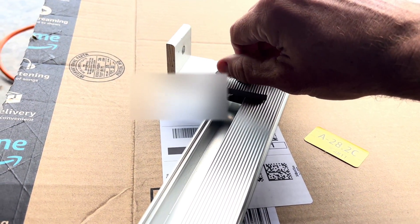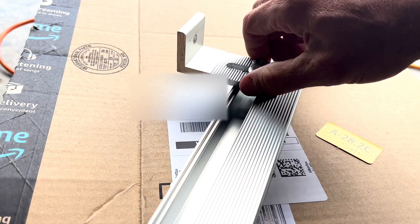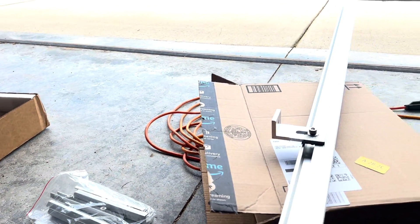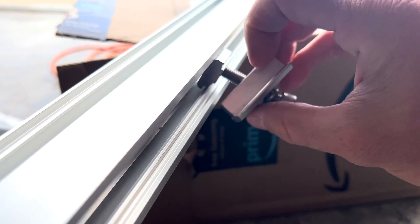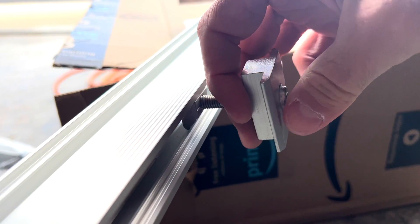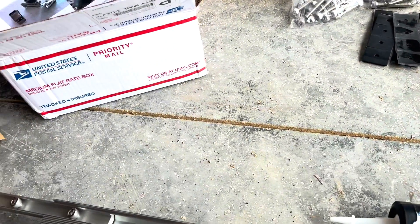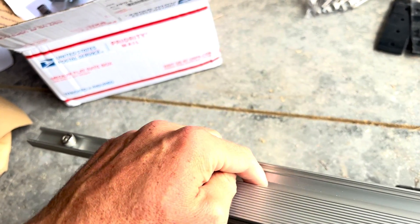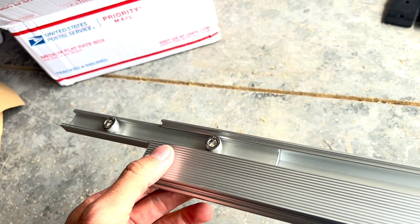On these feet, it has ridges that'll hold it in place once it's tightened down — the ridges will all lock in, keeping the feet held at the right length. The brackets that hold the solar panels on work the same way. There's a fat side and a skinny side. Just slip them in and it'll lock in place, then you tighten it down so that the T-piece or end piece grabs the top edge of the solar panel. The brackets that hold the two rails together fit in either the top groove or the side groove where the feet go. Tighten the screws down and it'll hold your two rails together in a straight line.